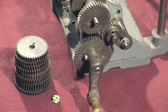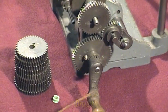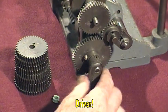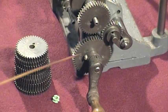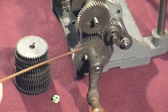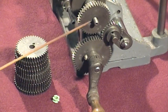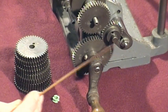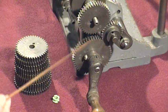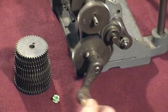From a close-up point of view, this is the gear train. We've got a driver gear, a driven gear, and then an idler which is on a slotted piece so you can adjust it to cope with two different sizes of gear. It's just a simple handle which is removable.